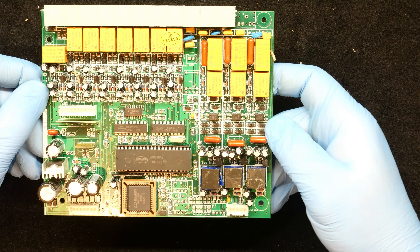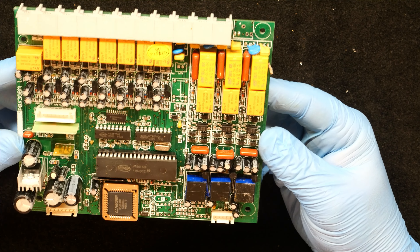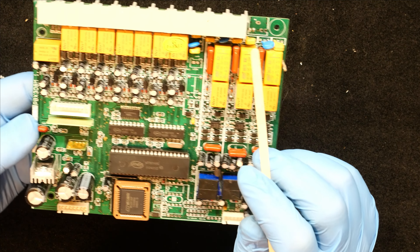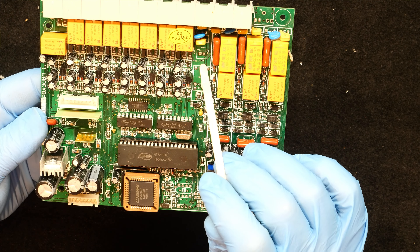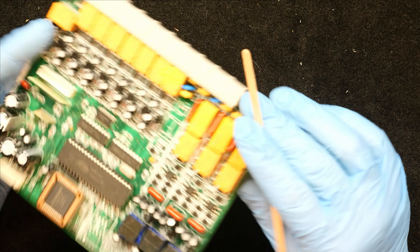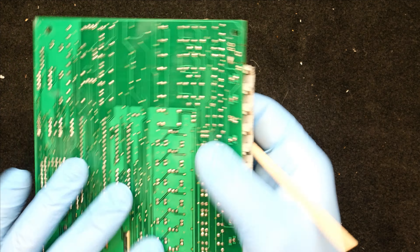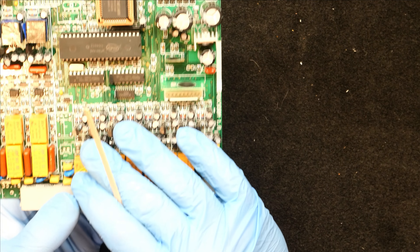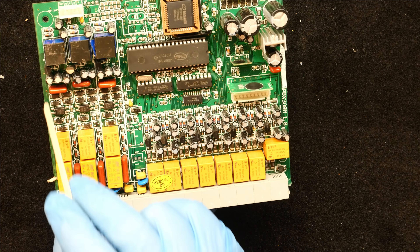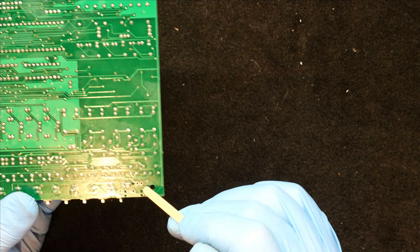Camera's moved again. Let's focus this down. We have another relay up here, and then something marked LCCK, which is tied into that relay. Whatever this is is tied into that relay. We've got a jack here that comes up the side of the board and goes into the multiplexer — so yes, we've got provision here for hold music.